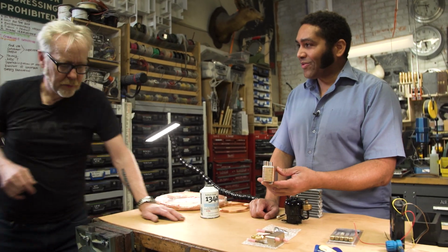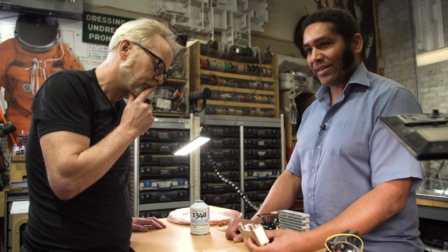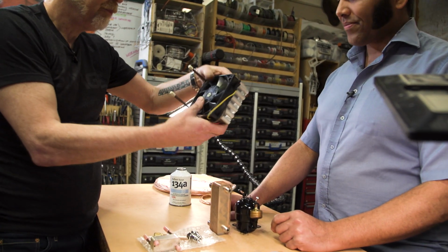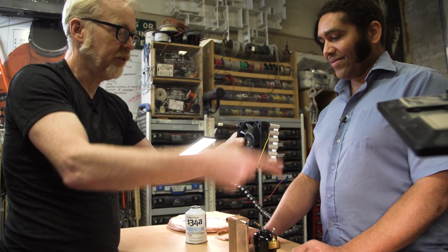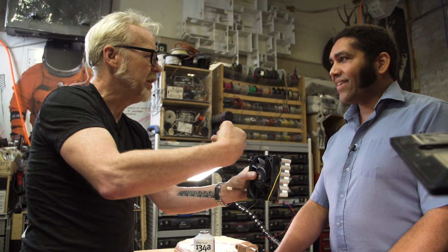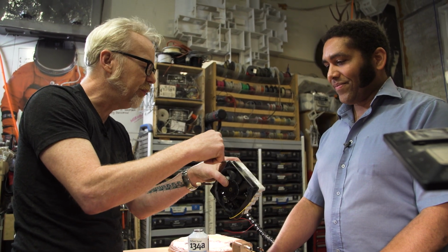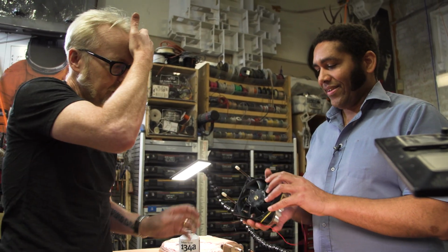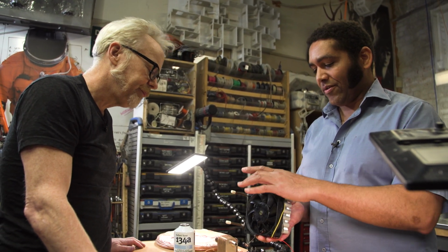We're going to use this mostly because we can put threaded fittings on and make it really easy to interface directly with your suit and pump. I would love to know if these pipes can be bent. While I have a lot of room to put in, let's say, a fake suit for a spacesuit, space will be at a premium. So I'd love to keep this X dimension as narrow as possible. I'm assuming we can cut these a little bit tighter. We're not going to cut them, we're going to bend them. Oh, okay, great. I've got some metal benders too, and some flange tools should we need those. We'll bend the copper tubes around so it'll create a nice flat profile.